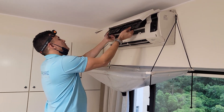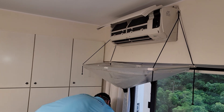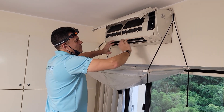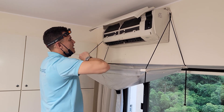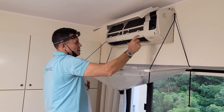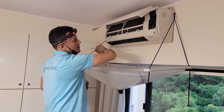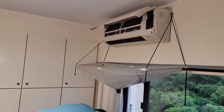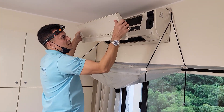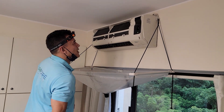Very, very easy. So open up the front cover, dismantle everything and get it ready. The louvers are very, very flexible and the plastic that Daikin use doesn't get brittle over time, so you can actually just pull it out one hand like that. It's fastened very simply onto two servo motors — actually one servo motor with a gear that connects the two. So you can literally just flex it and pull it to the right hand side and then pull it off. Very simple. Try that with any other brand of AC and you'll probably break something. A cover comes off very simply as well. You actually have to try pretty hard to break something with Daikin ACs.